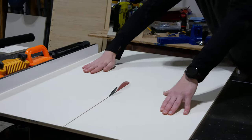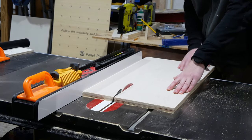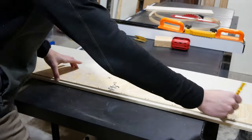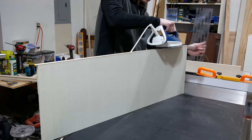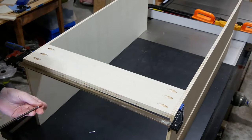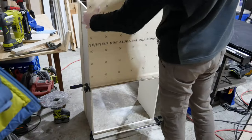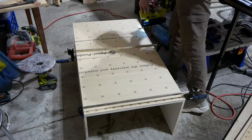The floating shelf box is very similar to the drawer box — built with half-inch plywood side panels and 5-inch strips of quarter-inch plywood. Where it differs is that there's a 5-inch stretcher across the top, a quarter-inch back panel, and it's shallower at 13 and 3/4 inches deep to account for variations in the back wall. I glued and tacked the quarter-inch strips to the side panels, drilled three pocket holes in the ends of the stretcher piece, and edge banded the side panels and stretcher. I clamped the stretcher at the back top of the side panels with the banded edge facing down and screwed it in place. Then I used spacers to hold the correct width, brushed on glue, placed the back panel, tacked the bottom corners, pulled the top square to the back panel, and nailed everything off.